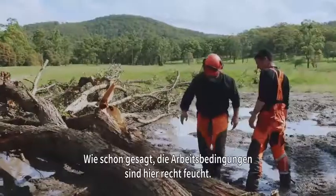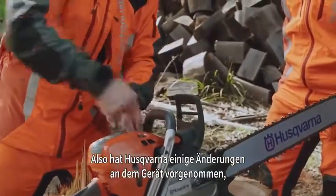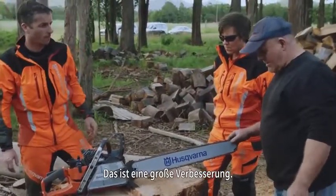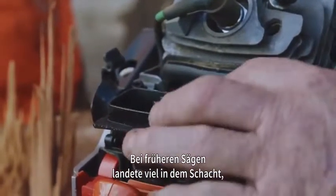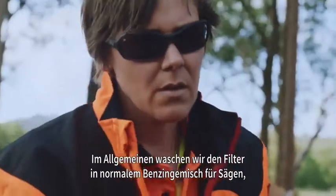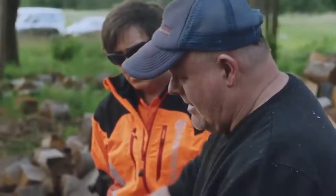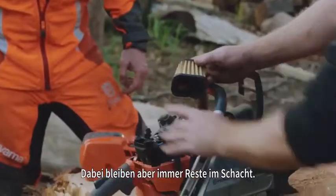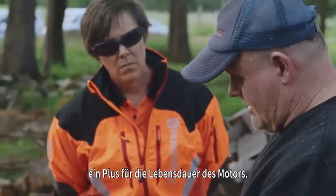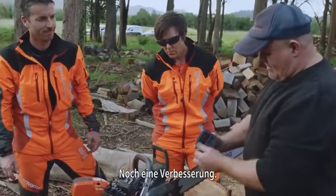Conditions here are fairly wet, but as a rule Neil's main challenge when operating a chainsaw in Australia is the dusty conditions. Husqvarna have made a few adjustments to the machine to make that a lot less likely to happen. Neil, what do you think about that? It's a great improvement. On previous saws, a lot of dust did end up in the chamber. With this saw there's a seal on the bottom of it, straight on top of the plastic, so it does bypass some. Usually we wash the filter out in normal chainsaw mixed petrol, let it dry or blow it out with air. You'd always see some residue going into the chamber, but with the introduction of that little seal it seems to have all but stopped it — which is a plus for engine life. The filters seem a little better now too, improved there as well.